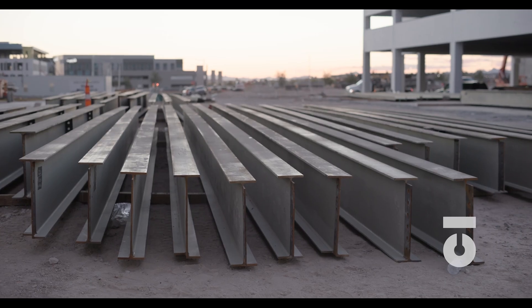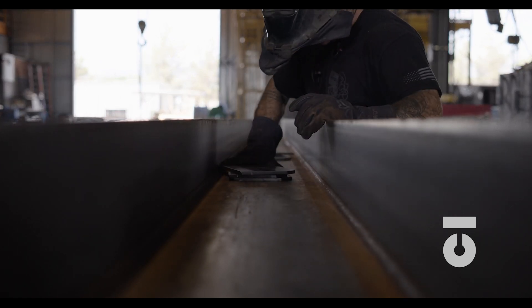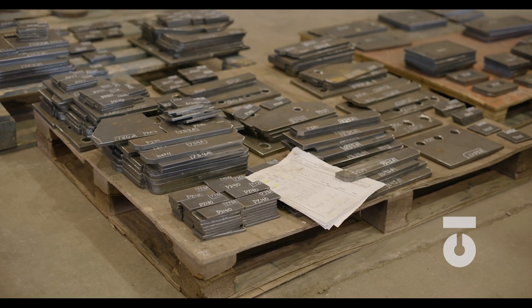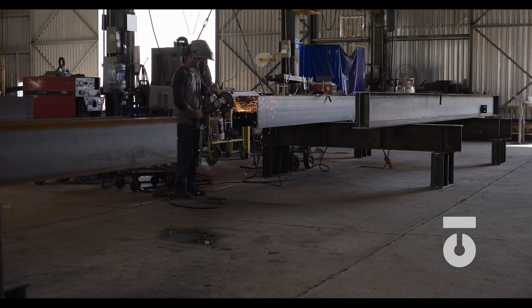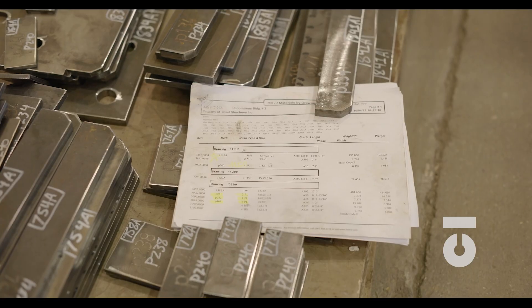Now let's talk about staging. With the significant amount of steel that comes through the shop, we need our shops blocked for staging at every step of the process. Assemblies may have various parts that will ultimately be fitted and welded to the main member — you could potentially have 32 plates with 11 versions of that plate. Without clear markings and proper staging, the shop would be a mess. Large steel member material should be on horses, dunnage, or steel racks to keep material off the ground, organized by job number, ship marks, and heat mark numbers. Parts should be organized by table or pallet. Time is money, but also an organized shop is a safe shop, which is most important.